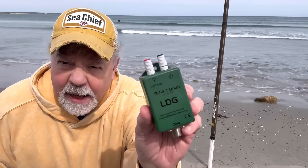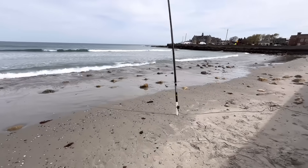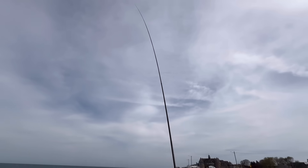Next up, my balun — or I should say un-un, 4-to-1 un-un. I'm going to put it at the bottom. Now, I said I was going to do this the right way with four counterpoise wires, but as you can see, the tide's coming in on me. I don't know if I have enough time — I want to get this thing done quick. So I'm using the other half of that wire and I'm just going to go with one counterpoise into the saltwater. My book explains everything. This can also be done with 4, 5, 16, as many counterpoise wires as you want, but the tide's coming in. I want to get this thing up quick to see if I can make a few quick contacts.